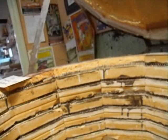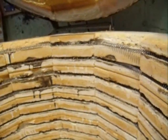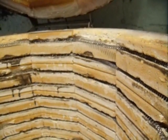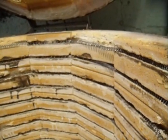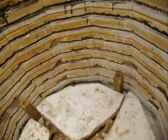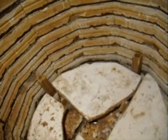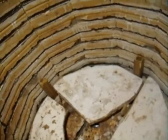The way this kiln operates is it actually fires just like a typical gas reduction kiln, except what I do is program this kiln to fire to reduction temperature. I go just electric to 1650. From there I open up the gas, and as soon as I open up the gas it ignites with the temperature inside the kiln. I have two holes on the lid of the kiln which are about one and a quarter inches.